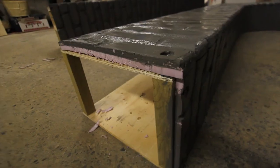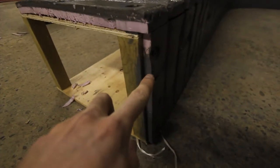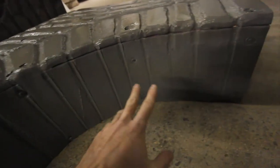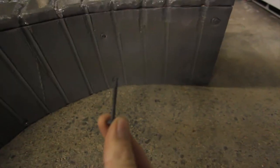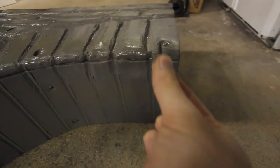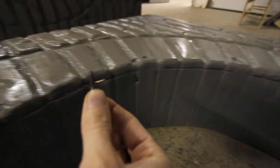There are two kinds of foam we're using: one-inch foam and half-inch foam. The one-inch foam goes in the flat pieces, and the half-inch foam goes all the way around here, giving us the ability to curve it. When we put this on, we're using inch-and-a-quarter screws and screwing the foam right into those nine-inch brace pieces that were secured from one piece of plywood to the other.